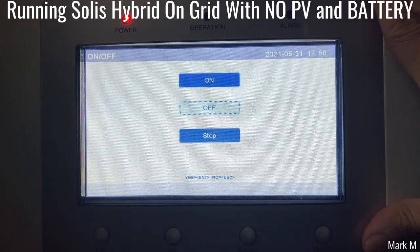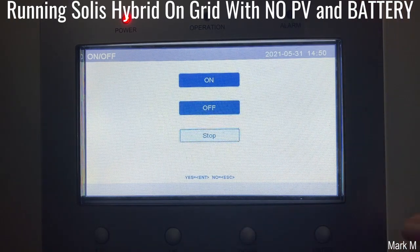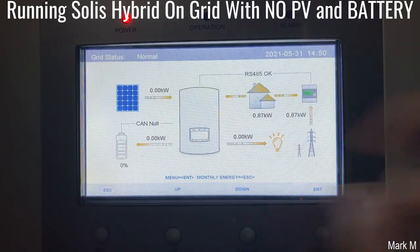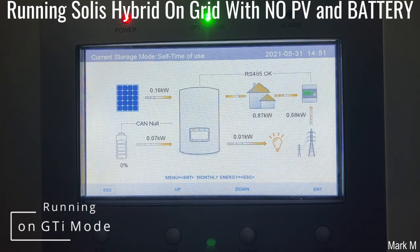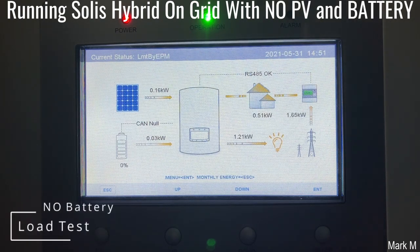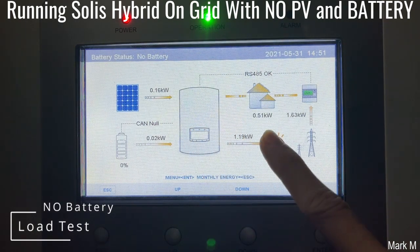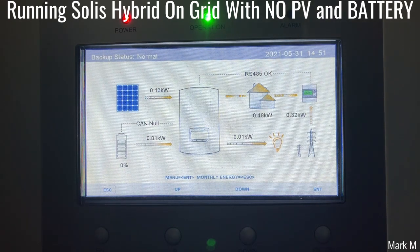Also, if you're going to turn on and off your inverter without resetting it, you don't have to wait for 10 minutes to re-sync — that's also the advantage of it. Turn it on. Now we don't have any battery. It will automatically supply power. We don't have a battery, and we have a load. Let's simulate a load again — it will get everything from the grid. As you can see, the arrow is going to your load. Let's turn it off — and it's zero.